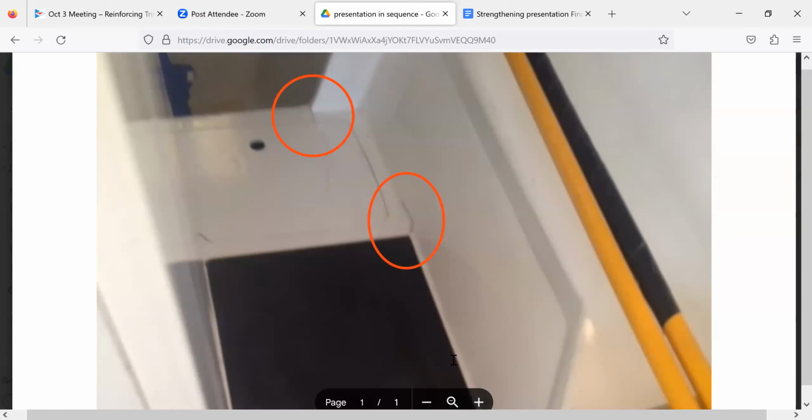If you were an engineer designing this boat, you would put a straight piece right across from where those two struts attach to the hull. But there's actually quite a dip where the hull comes down. So when that ring frame cracks, it actually spreads the boat apart. I could stick my pinky finger in between those cracks. It was moving about a third.